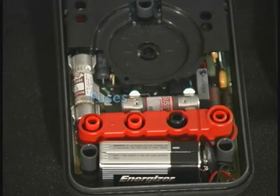We also have some fuses. The fuses are there for protection of the amp circuit in case too much current goes through the meter. It won't damage the meter — it'll simply open the fuse. Make sure you use the fuses that are designed specifically for your meter, so refer to your owner's manual for that.